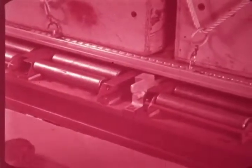The next pallet is ready for transfer. The staging is raised, leveled with the aircraft, and quickly adjusted to the changing level of the airplane. Use of the forklift also permits easy adjustment of the staging to conform to changes in the level of the aircraft floor as the pallet is moved out. Manpower alone is sufficient to move pallets at safe speeds. Simple and easily operated stops hold the pallet in position on the roller conveyor section of the staging, and side railings contribute to personnel safety.